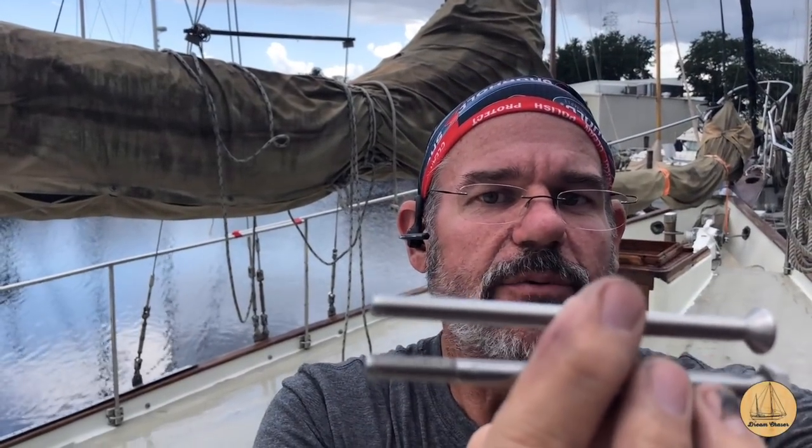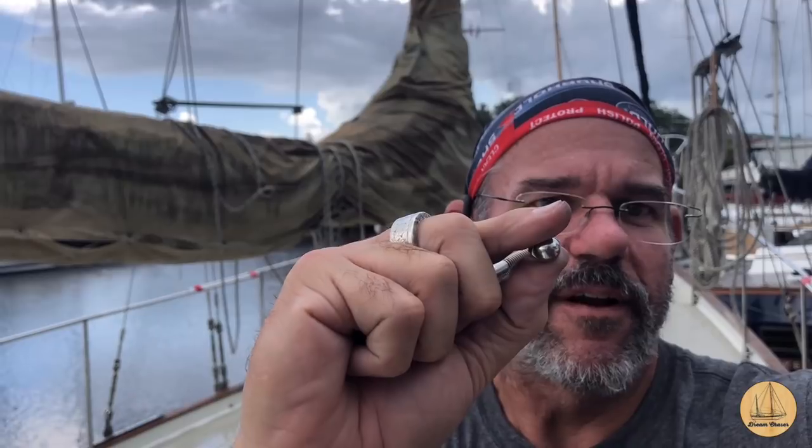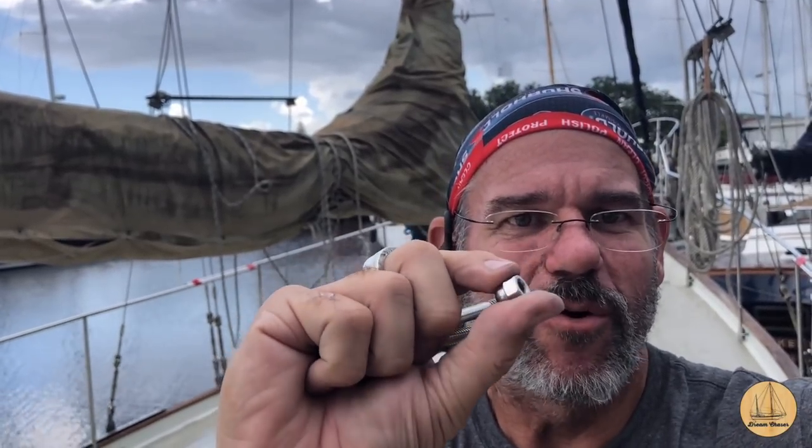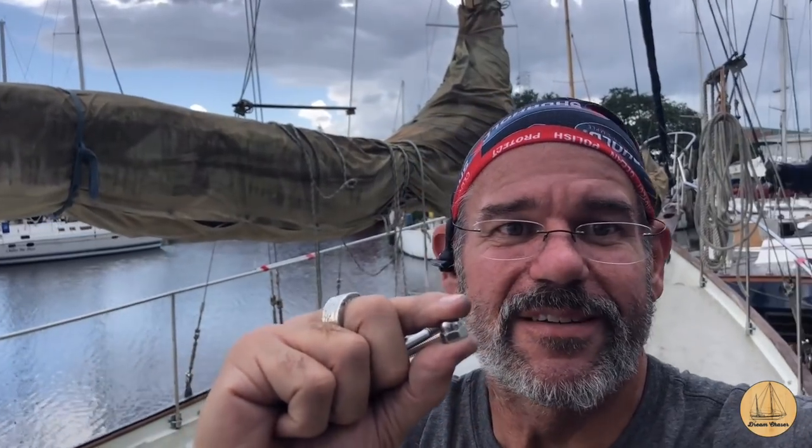So I had originally had this one. It worked fine. Then I went and bought this one, also 4 inches. It looks like it's actually a little shorter than 4 inches, not quite enough to grab at the end of it. So what I really need is something like 4 1/4. Because I'm trying to use these acorn nuts with the decorative ends on them, I only have about 1/4 inch of depth on that, so I can't go more than about a 4 1/4 inch long bolt. Otherwise, things are going to tighten up.